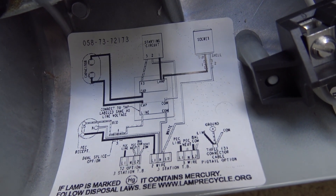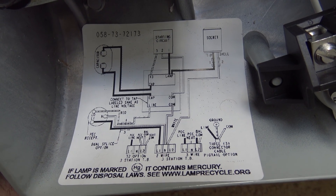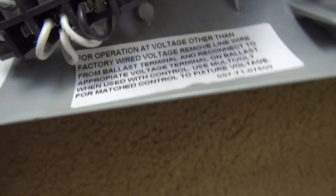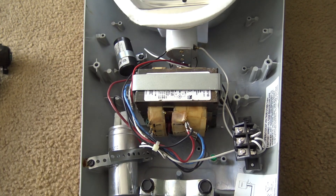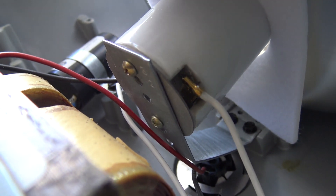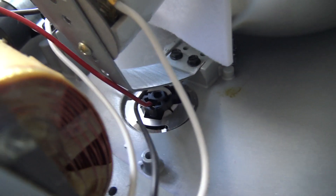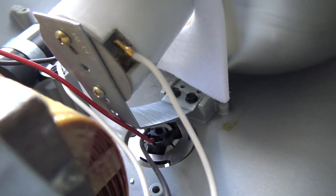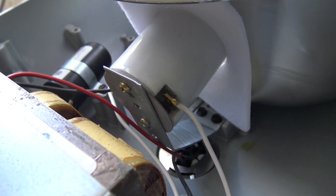One thing that's really cool is the wiring diagram we can see on here — it's super cool to see a fixture with its wiring diagram intact. A lot of my older ones don't have any of the stickering left. You've also got your little warning there for operation. Nothing in here has really changed other than the ballast assembly being made for a different type of lamp. Here is the light socket — same as my high pressure sodium 125. You've got three positions for vertical adjustment, and for horizontal adjustment you've got those little steps back there and you just unscrew it.